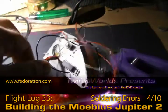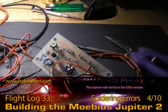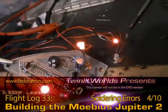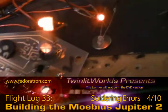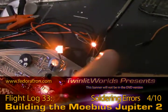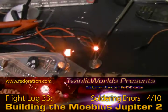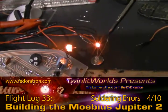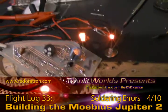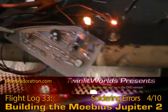With board number two — the little guy over here — let me get that powered up. Two out of three LEDs are lit. I've tried two different LEDs, flipping both polarities, and neither of them work, so I'm guessing it's not the LED, but I haven't made a hundred percent sure look at that. The brightness works, so I can dim that, but there is no speed to change, of course.